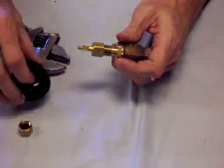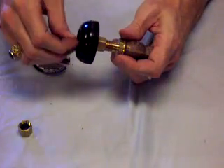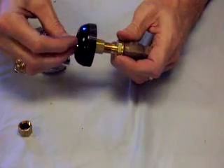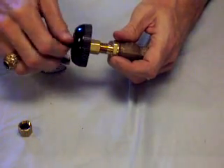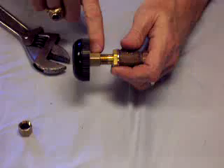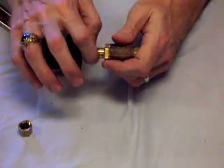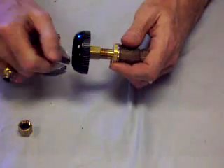Replace it with the new nut, tighten it on there relatively tight, not over tight, put on a new knob and the nut, then test the boiler. You will get some leakage around the shaft with the new packing in there. As you have that leakage, tighten it up a quarter of a turn clockwise at a time.